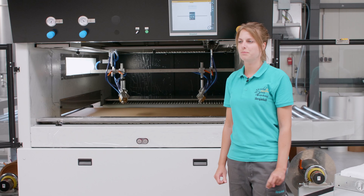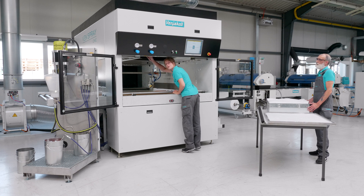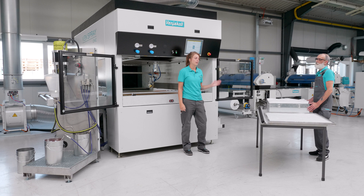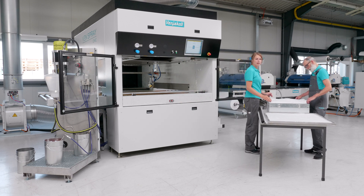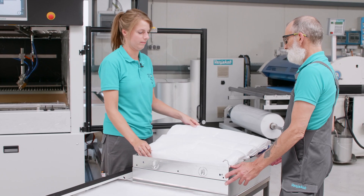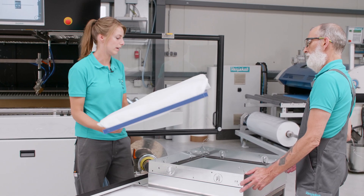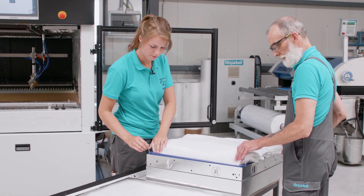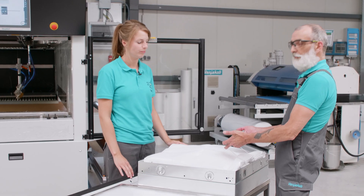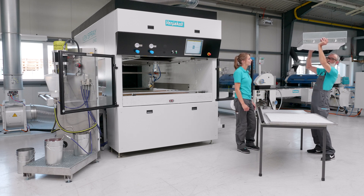After we have replaced the filter cartridge, let's move on to the next filter — the pocket filter. The pocket filter is located up here, really up here under the ceiling at the air supply valves. You can climb into the machine, but it is a little bit tricky, and that's why we show you this on the table. First, you have to loosen the clasps that hold the filters in place. Then you can take it out and change it. It is important that you remove the straps only after the installation, because the filter hangs over you during installation. Only then, when you remove the bands, the filter unfolds and is ready for use.